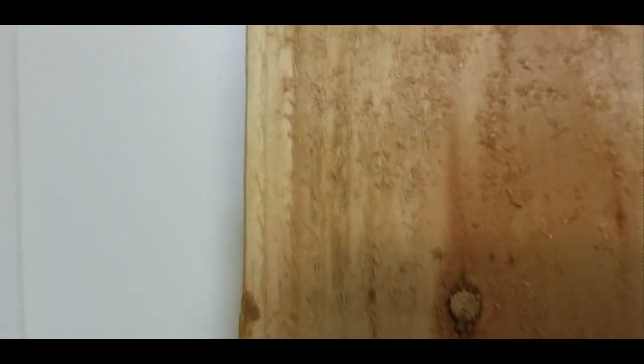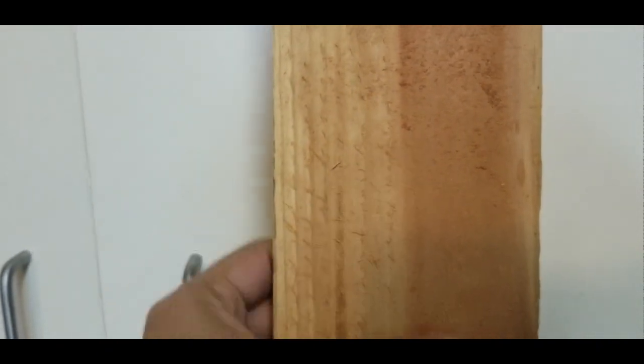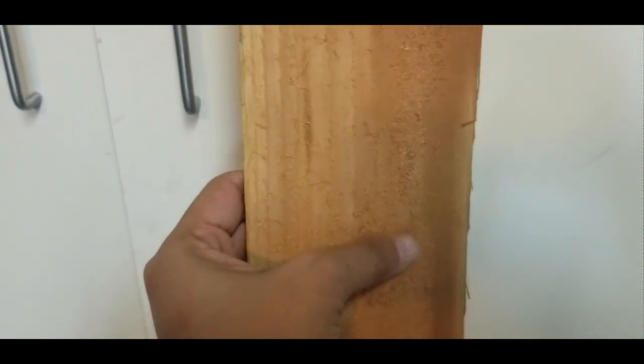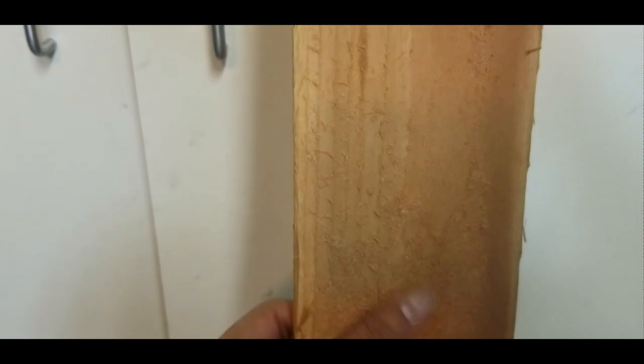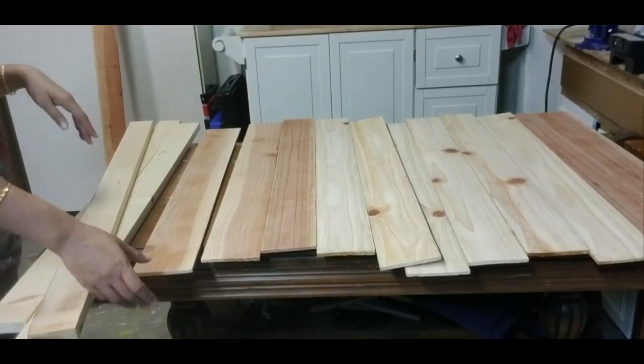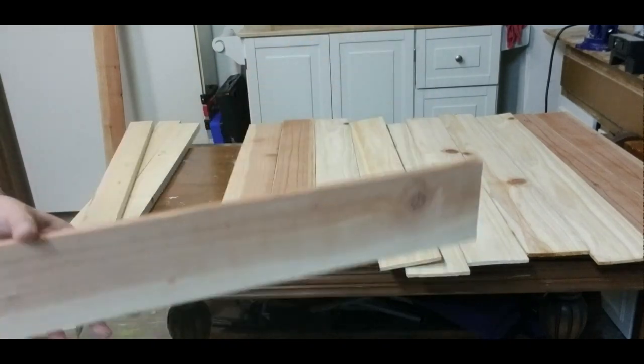The reason I chose this board is because it is very lightweight and easy to handle and work with. The finished product is not very heavy and can be easily wall mounted without any worry about the weight. The second reason is that it costs less compared to using other types of boards. You can see lots of sawdust sticking to these bender boards. Before buying, carefully examine each board for proper edges and wood deformities.